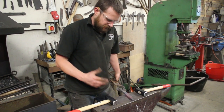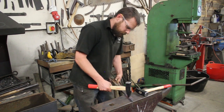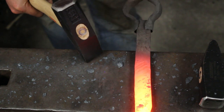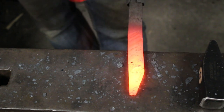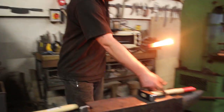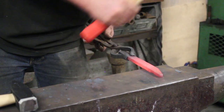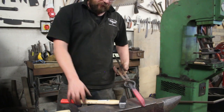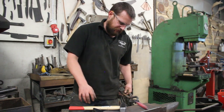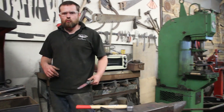I'm going to put in a few more marks to emphasize the point. I'll use the cross-peen on this bar and then forge another short taper with the other hammer. Forging that taper with the dressed hammer, I've used the face and I'm not going to fuss this too much because the whole point is to show you the hammer marks these things leave behind. I'm going to take another heat on this bar, use the heel and toe and cross-peen, and show you the difference in the cold pieces.